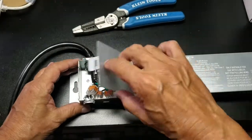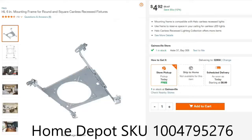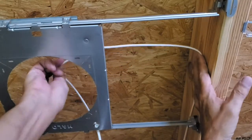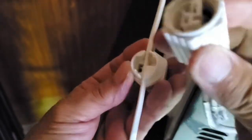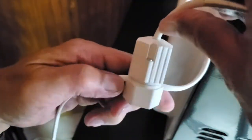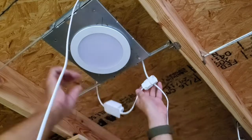Here's what my electrical compartment looked like after I attached the AC line to it. I chose to mount the power supply to one of my ceiling rafters, and I'm using a mounting frame between the rafters to put my downlights into. Then, using a rule of thumb, I estimated how much slack I needed in the low-voltage power line. To make the connection, begin by unscrewing the two-piece connector. One side has a slot in it that you will insert the low-voltage cable into, and the other side fits over the slotted cable side. It's keyed so it can only go in one way — you twist the non-slotted side down until the copper stakes inside puncture the insulation on the low-voltage cable and make contact with the copper conductors inside.